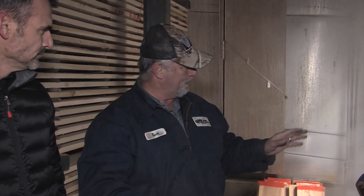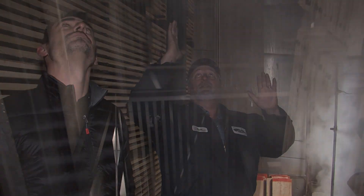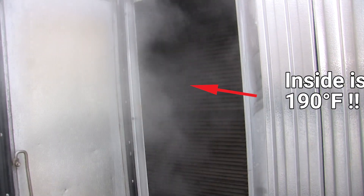What's going on back here? We've got steam and a little trough. This is our drop-off for the condensate. Whenever we get ready to close the kilns up, we turn all this off — this is currently running to keep things from freezing in the cold weather. Then the fans come on and the steam starts going through the coils, heating everything up. It'll get up to temperature in about 12 hours. I just stuck my head in a working kiln and that is not a place you want to hang around — it's very hot. It's cold outside and I'd rather be outside. We've got all this poplar, so now let's go see what the finished product looks like.